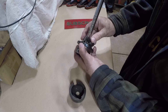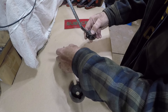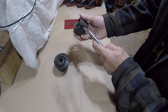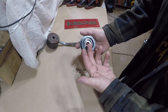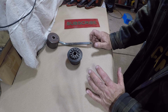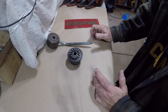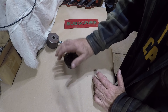The quill handle latches into these cogs — gears, whatever you want to call it — and it turns the quill. As you can see, this is really janky: it's loose, the springs have been long gone, the handle would fall down and get in the way, and the clock spring is non-existent so the quill would fall too. I'm upgrading this to a speed handle for a Bridgeport, but even though they call these clones, these are two different machines.